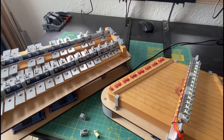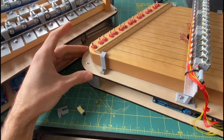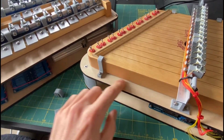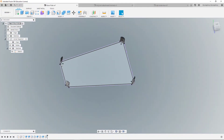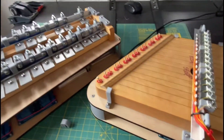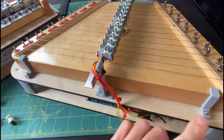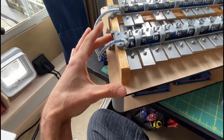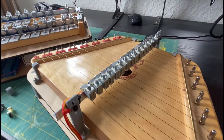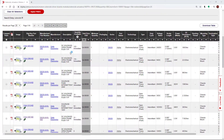Let's start by talking about the upper part of both instruments. You can see that they're mounted on top of laser-cut plywood, which I made by recreating the outline of the instruments in Fusion 360 and then using the offset tool to add two centimeters around the edge of each of them. They're held down with simple 3D printed clips which keep them from moving fairly well. The mechanisms that actually strike the notes are small five-volt solenoids that I got off digikey.com.